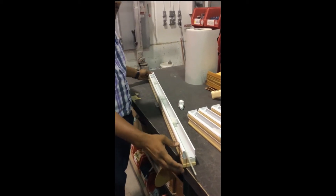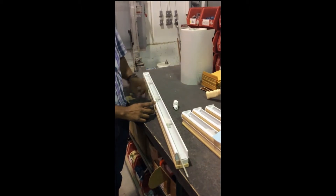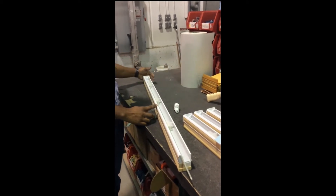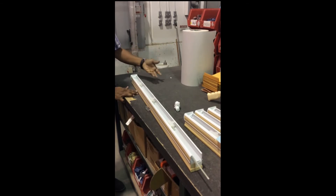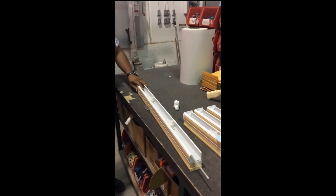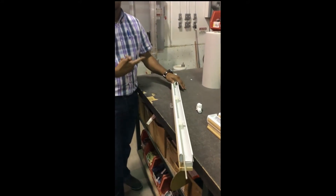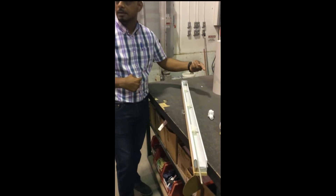You might find a cordless bottom-up top-down will have two drives, two systems. The front cord — the bottom-up — is always on the front. The top-down is always on the back. So if you have two drives, the back cord will be turning the opposite direction, and that's exactly how the motor cranks — the opposite direction. The standard cord lets the motor crank in the direction that the cord is rolling on the spool. For a standard, it cranks towards the front, and if it's a bottom-up top-down and it's the back cord, it cranks towards the back. That's how the cord wraps with tension on it.